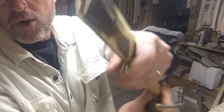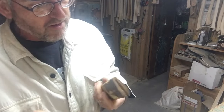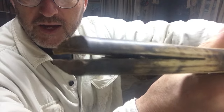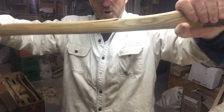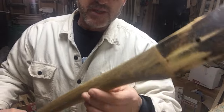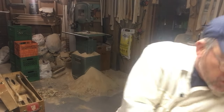There's a little bit more wedge at the bottom still — just get the screwdriver and pop that out. If that was a good handle I could pop it right back into another axe if I wanted to, but this one's broken. It's ash — still fairly tough — but it's destined for the fireplace. So that's this week: tightening up an axe head and removing an axe head.